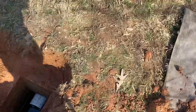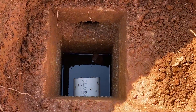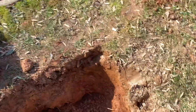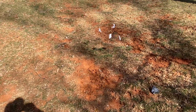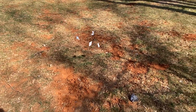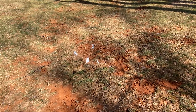In the back of the tank we have something called a baffle. The back baffle's job is to keep all the floating stuff and debris from getting into the pipe over to the distribution box — it's literally just a shield. In the tank itself you're going to have three layers of separation: sludge at the bottom, effluent in the middle, and scum up top.